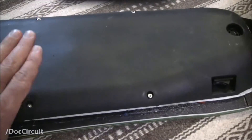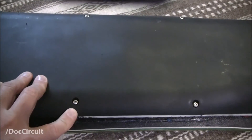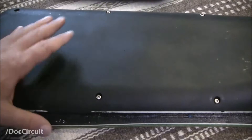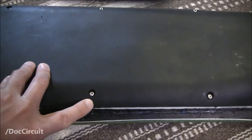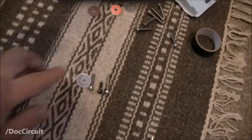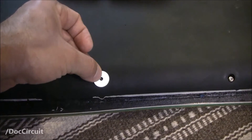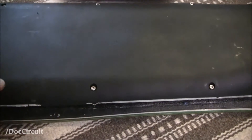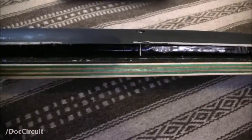Having said that, the plastic is soft and if you over-tighten it, or it takes a lot of weight — in other words the second battery — and you squeeze it in and clamp it together with these bolts, there's a good chance you can go right through the plastic. So what I've done as a test, and ideally what you'd do to take it out and ride it, is get longer bolts still and have washers, so the bolt goes through and into a metal insert in the wood. That's quite secure, and that way you can clamp this whole thing together without going too tight but still securing everything securely.